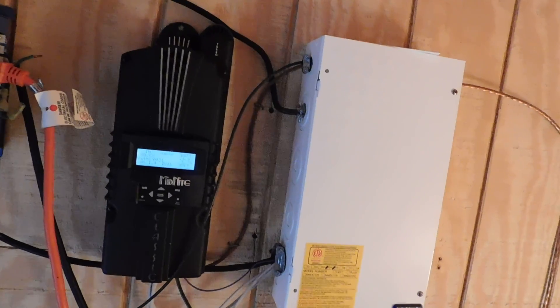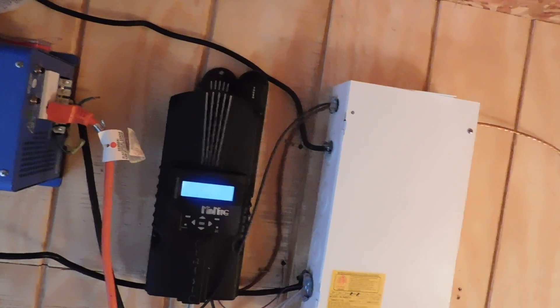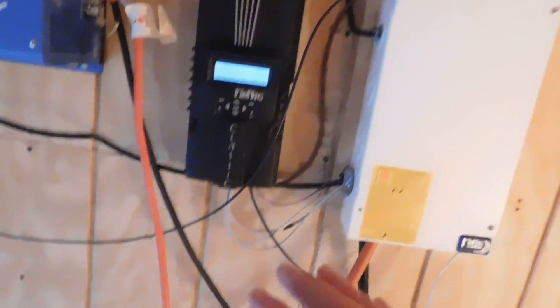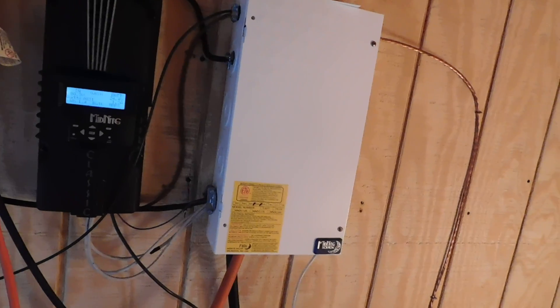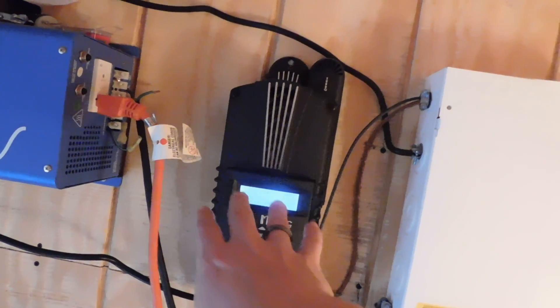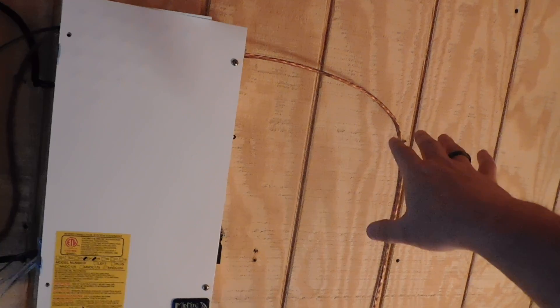With the two Midnight Classics I could take the system up to 4500 watts without a problem. Eventually I'll need to add more batteries — no doubt about that. But the focus right now has been getting more solar panels. I bit the bullet and bought the second Midnight Classic — the new panels go on that one, the existing 1500 watts stays on this one, and as we buy more panels later this year we'll add onto that second string up to 1000 watts first.